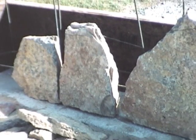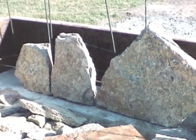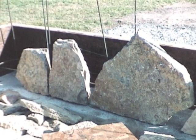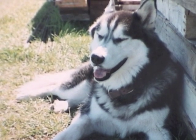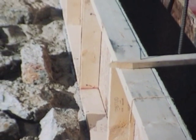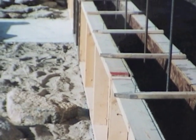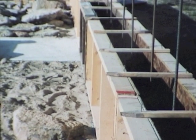There are several different ways of building slip formed stone walls, but the most common method is to make a hybrid wall that is half stonework and half concrete reinforced with steel. The slip forms are placed on both sides of the wall and held together with wire ties at the base, as illustrated in my book Living Homes.